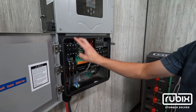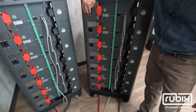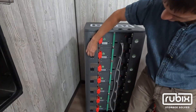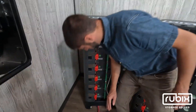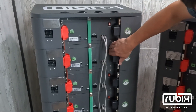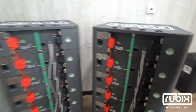We are ready to turn on the batteries. First, we're going to make sure the Solark's breakers are off — we'll get to that last. Now we're going to go through and turn on each individual battery breaker. This is the fun part — we are ready to fire things up. Breakers are on. We're going through the switches — the little red on/off switches. No explosions so far, and they're on. We are ready to put on the covers and push them in place.